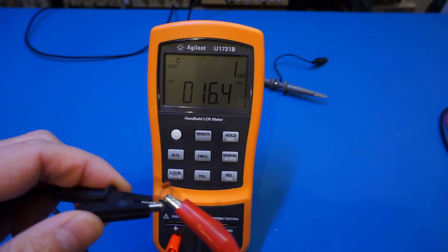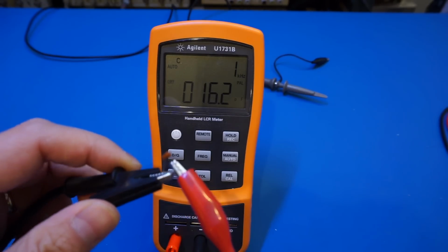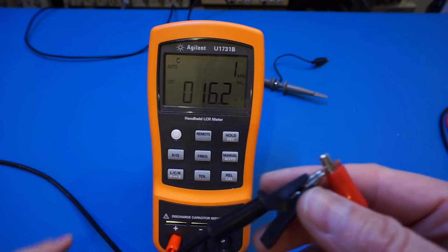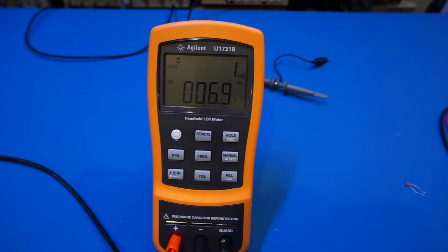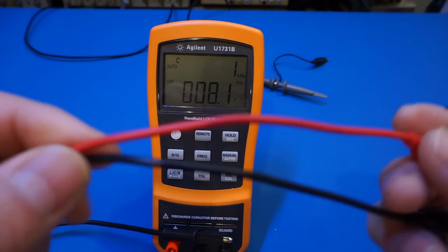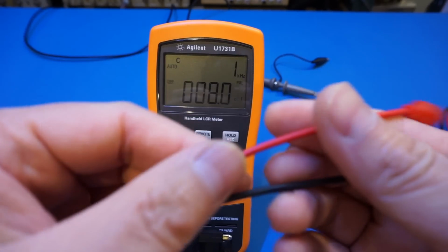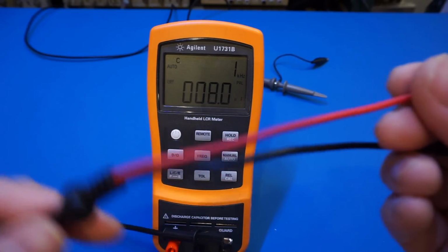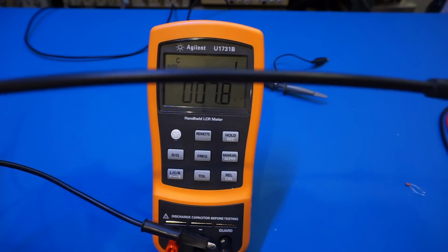And perhaps the most important part is that the residual capacitance is fairly stable. Instead of like before, when we move the wires, it changes quite a bit. Here it actually doesn't change that much. So this is why we need the guarding when making this kind of small capacitance measurement, and that makes it much more accurate. This is because the guard potential is held at the same potential as your signal wire, so that there's no current flowing between the guard and your signal, and thus preventing the stray capacitance from getting into the equation of our capacitance measurement here.